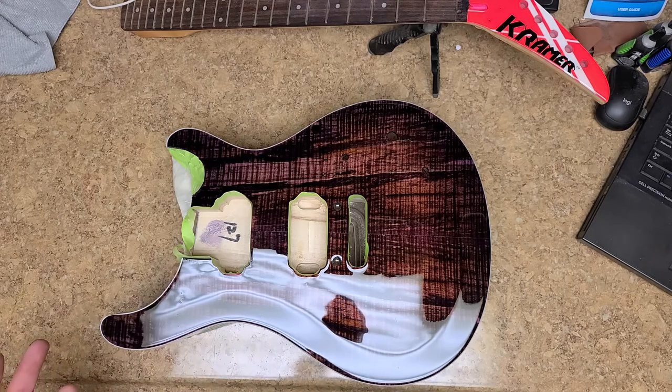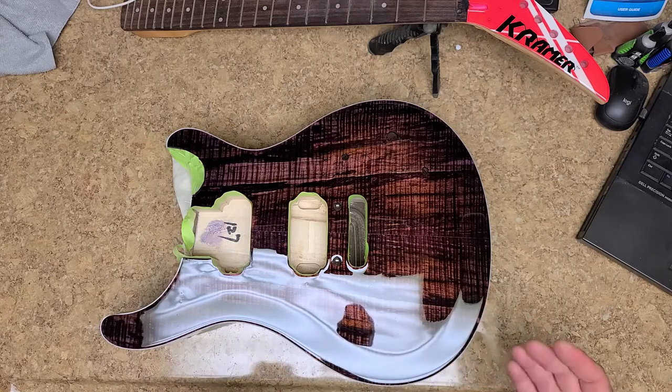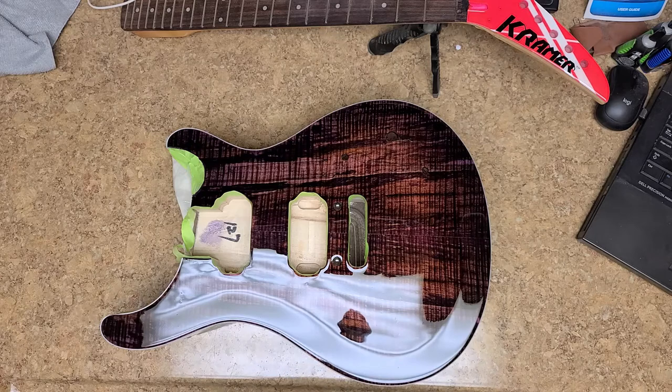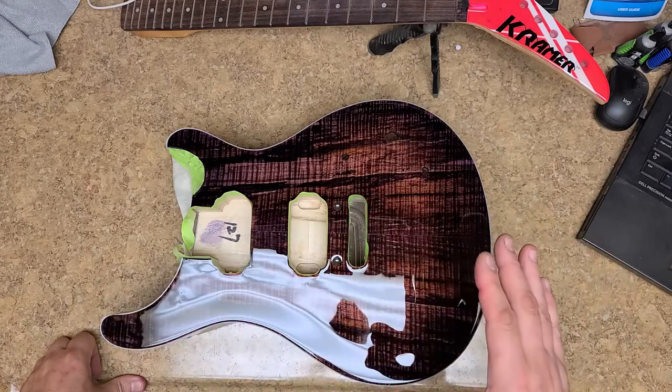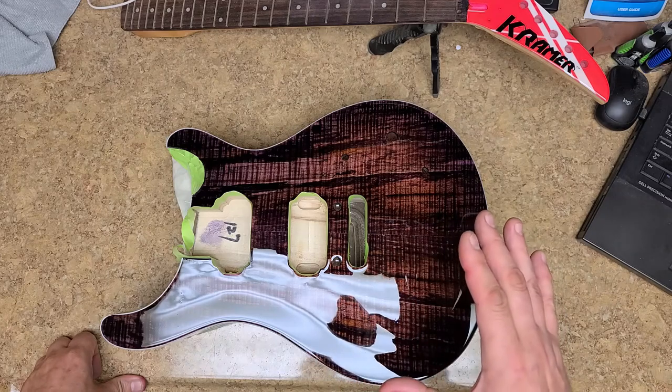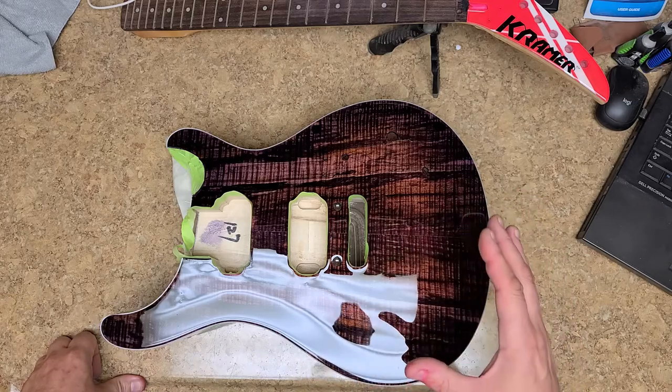Although after applying the epoxy resin and then going upstairs, like I said, we had some bad storms coming through here, enough that it shook the house as far as the thunder goes, and I think lightning struck the parking lot behind the house. That ended up, I guess, releasing some dust from the ceiling in here, these ceiling tiles. So there's a few little particles inside this finish, which is not a big deal, because once this cures 100% I can sand the top down and reapply another coat, which is basically what I was going to end up doing anyways.